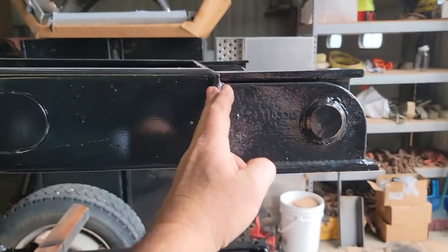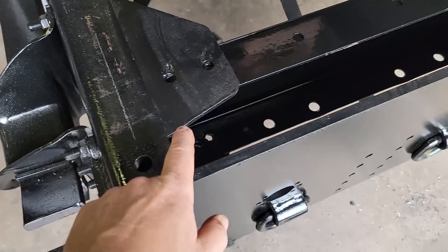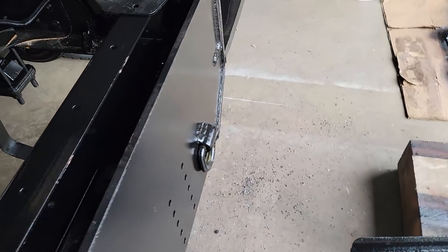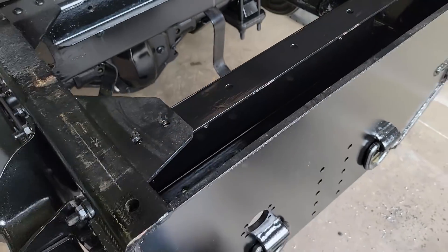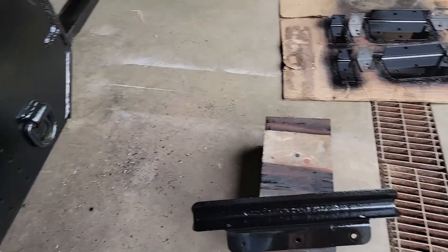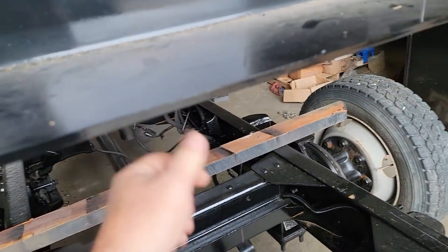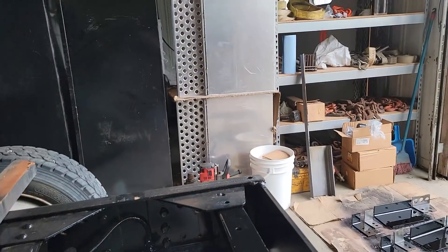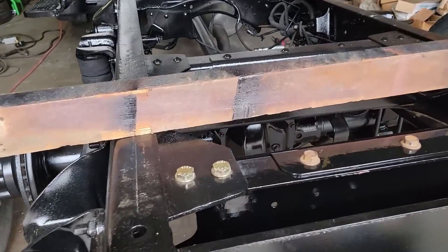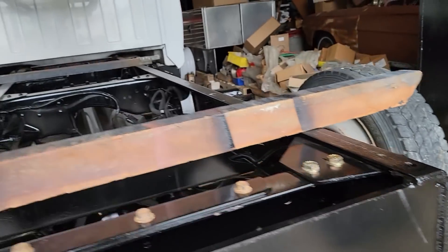You can see how this hinge is made and how much space it takes. Before I can set this down and bolt it in place, I need to get this crossmember back in because afterward I won't be able to get the bolts in. I need to go get some half-inch bolts — I'm going through less than half-inch of material, and I need about eight of them. One thing that might be interesting is the factory bolt heads are pretty tall and may hit the bottom of this. I don't want to have to drill holes to make it sit flat. Took me a little while, but I found bolts with low enough heads to allow a washer and still sit below that plane. So now we can move forward.